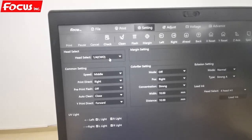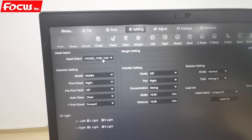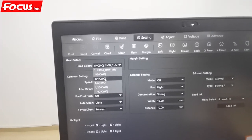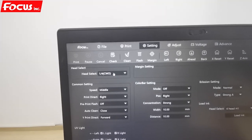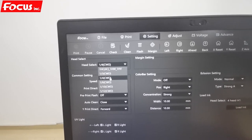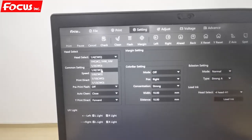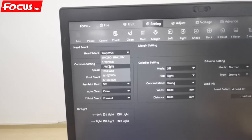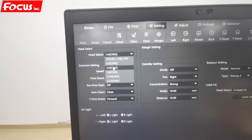Here we choose not full ink. To print the bottle, the varnish cannot be used. So first we choose the size: how many nozzles print ink. Also, as I said before, it depends on the size, the cube size, the cube gap of the material. If you print a big bottle, then you choose fewer nozzles, like 1/3 or 1/4.